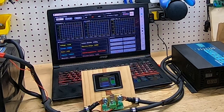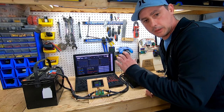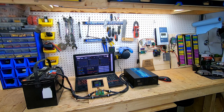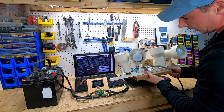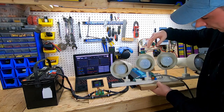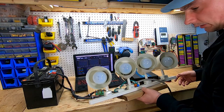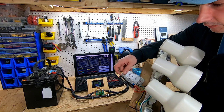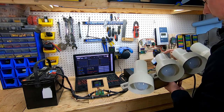That's as much as my inverter can do. Let's get a load and hook it up. For my load, I've made this incandescent light setup here. This will give me a nice steady load so that I can do proper testing. I also have a dimmer switch, so in case I need to go up or down with my load, I can.